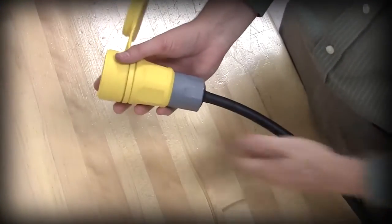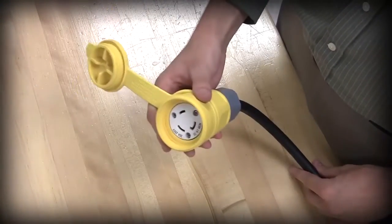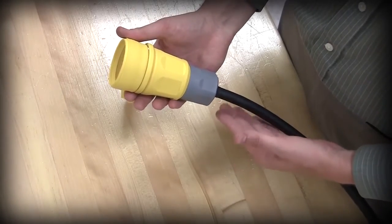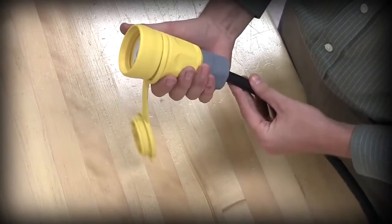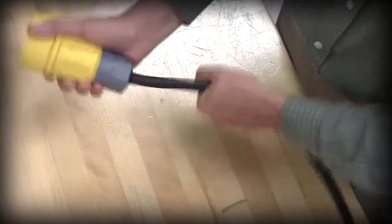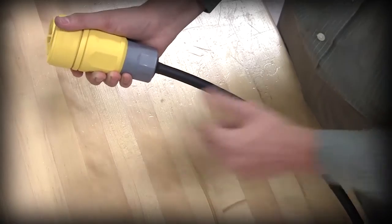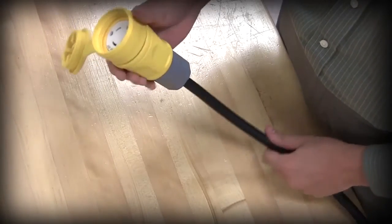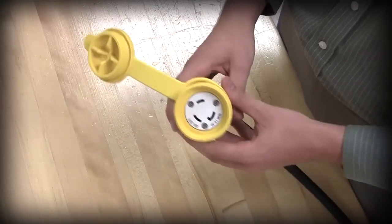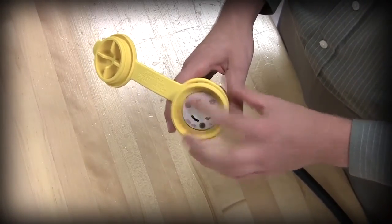Congratulations! Your watertight device is now installed. Ensure that the gotcha ring, rubber bushing, closure cap, cone seal, nut, and rubber housing fit the wire snugly. When pulled or pushed, make sure the wire does not move. Be wary that the nut is screwed firmly to the rubber housing. Examine the stainless steel screws, as they should all be tightly secured.